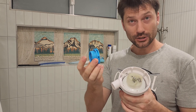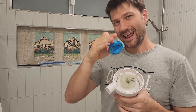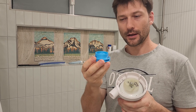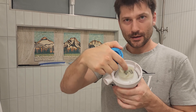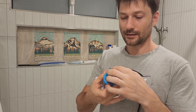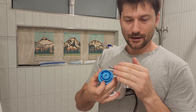That's why the closed impeller is supposed to be more efficient. Not only is this more efficient, but with the 3D printer I can print different diameters and different angles on the impeller blades themselves. This is quite a well-engineered little pump, and what I've done is from where this hub is, it just drops down three millimeters — I've kept this hub and the housing over the closed impeller.